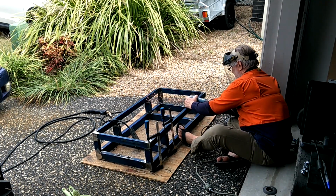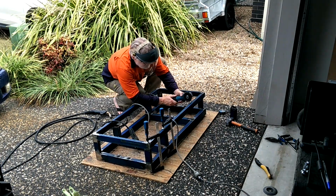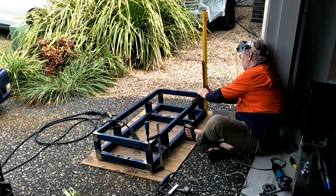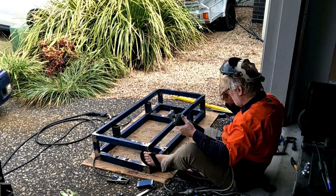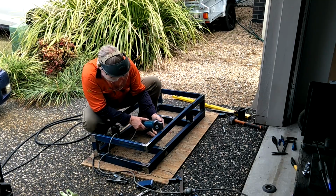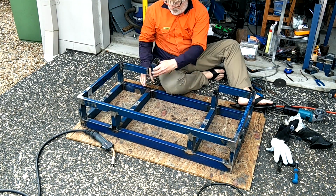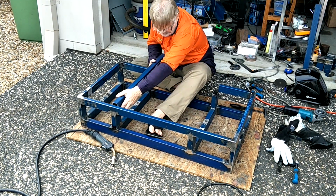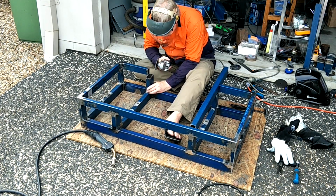I've reached the point where I can't do much more welding before I need this top section removed. I was trying to leave it to the very last minute to maintain as much rigidity and keep it as square as I could for as long as I could. Trying to sneak up on a tight fit felt like it took forever.